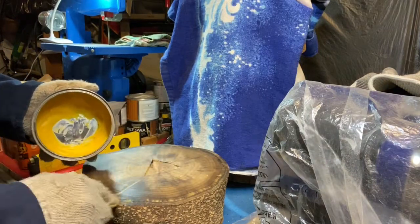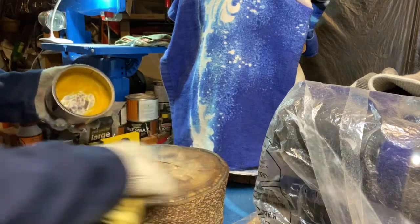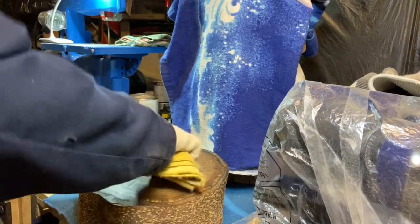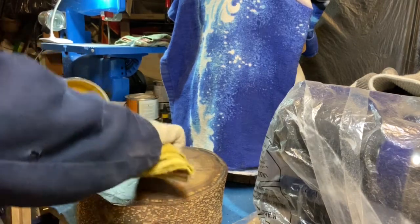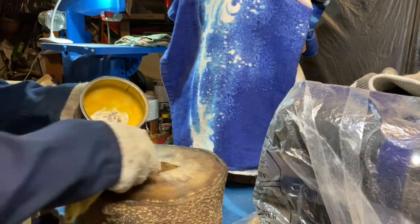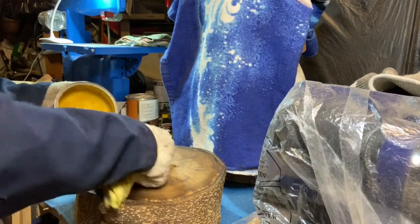That's beautiful — a couple of small minor abrasions there, they'll just cover up nicely. Into the nice recess — this has been quite smooth. Sometimes you'll get little holes that can't really fill in, but obviously with the glue and the sawdust it's easy to fill those up, and again the wax absorbs in really nicely. Okay, so that's the first coating done.